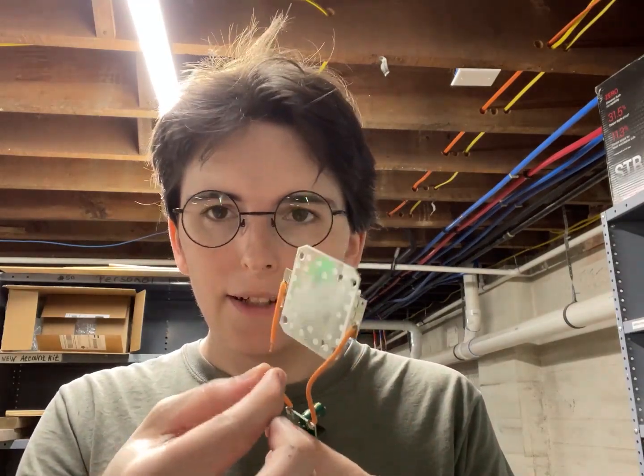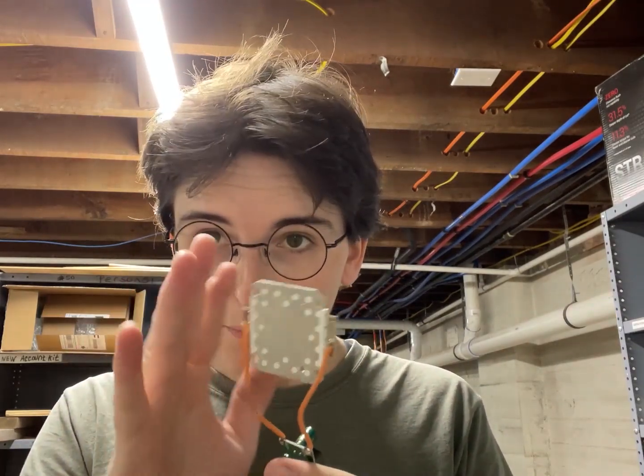For some reason, the voltage output was stuck at 38 volts. This little converter just was not limiting the voltage, even though it can handle up to like 130 volts DC. That was an 80-volt power supply. So I disconnected it just to see — was I just way too high on the potentiometer? I kept turning the potentiometer and it just wasn't changing the voltage. I disconnected the wire so I could see it without load and without worrying about burning it up.